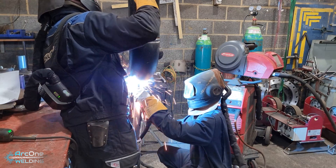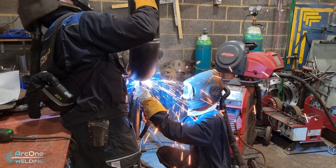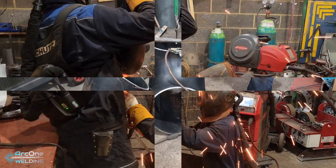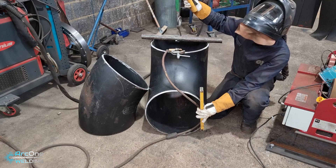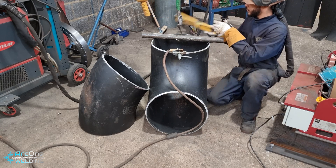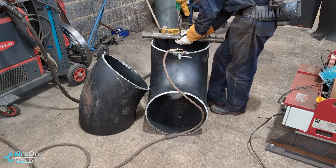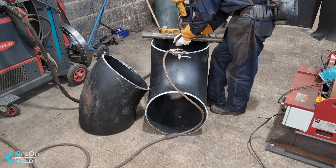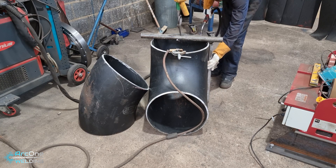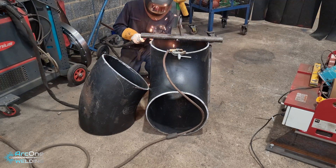That's fine — it works on small stuff, and if you've got a big or small gap you can deal with it. But on big pipe where you need to maintain a consistent gap across a 450mm cut, you need it to stay weldable. It's so easy to end up with gaps where fingers can fit in between, and that's a nightmare. So this way, I practically set it up with the correct set measurement and cut it out.